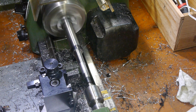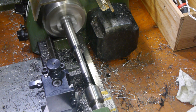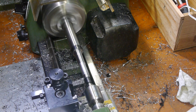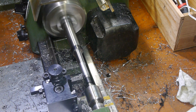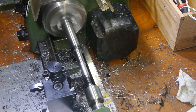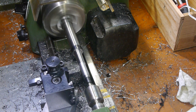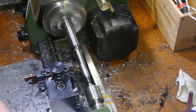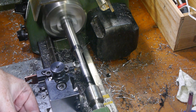My first attempt to make the parting cut wouldn't bite. I was relying on the taper not being too hard, as it's a cheap tool, but the outer surface was hard enough that a carbide parting tool couldn't get enough depth to cut. To give the tool a better chance, I used a regular tool to skim away the surface material, hoping that it was case hardened and that the material underneath would be easier. After a few more adjustments to the tool height, it worked. The material underneath cut pretty freely.